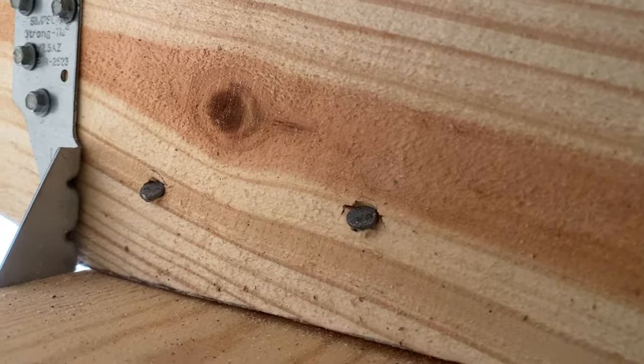The other thing I wanted to point out up here, and we talked about this in a past video, is that I'm using a non-structural ridge here. One of the things that's really important to do with rafters and a non-structural ridge is to tie them together using a collar tie or a cross tie, as they're sometimes called. That's just a piece of 2x4, almost always located in the upper third of the height of that rafter pair. In this case, a 4 foot long 2x4 fell right about where it needed to, so it was a convenient length to cut for these cross ties. Those are screwed into each rafter with three GRK structural screws.